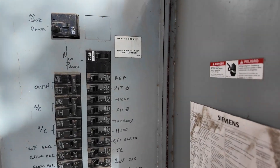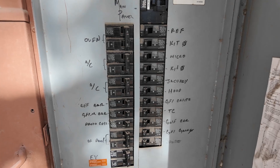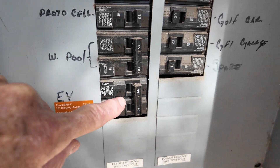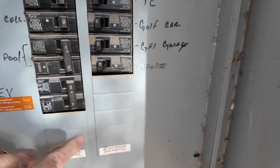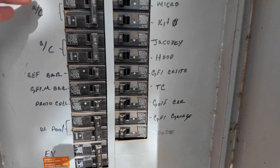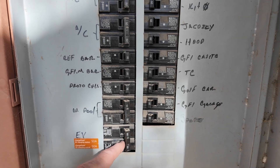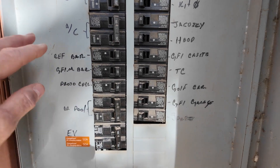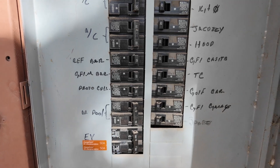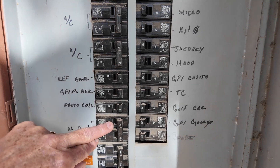Here is what you need to look at. You can see all of the breakers in my panel coming into the house. I put a 50 amp breaker in right down here, and I have space for more breakers. That's really what you're looking at — finding out if you have available space to add a breaker. I put 50 amp in, and ideally you'd like to do 240 volt wiring connected in the garage. You can see I have other 50 amp circuits in here.